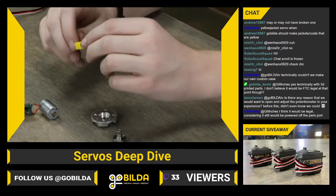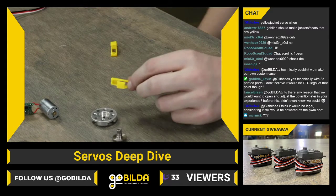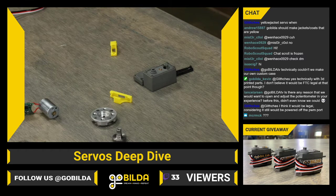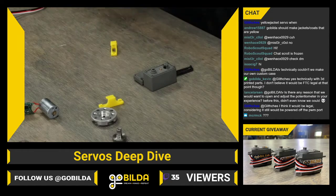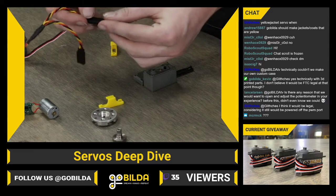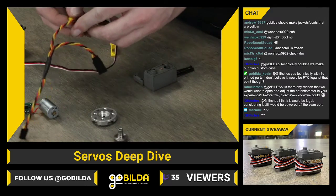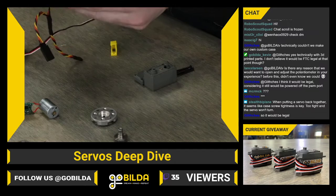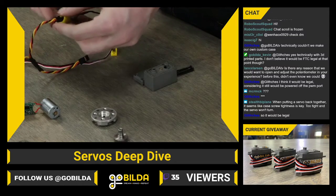Another fun thing that you can always take a look at is a retention clip, just like this one. This is great if you're working with extensions and you want to make sure your servo never gets unplugged from the extension. That can definitely happen every once in a while, and it's really not optimal. It works like this: if you have one of these extensions with the plastic clip case right here, you'll want to make sure you align the signal wire on your servo and your extension. In this case, it's a yellow wire to a white wire. Then, making sure those are plugged in all the way, you can install this clip and just rotate them into place. These are fairly inexpensive, and they're a great way to increase the reliability of your system, and they make everything just a whole lot nicer.